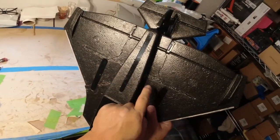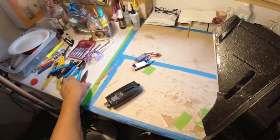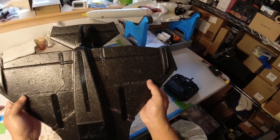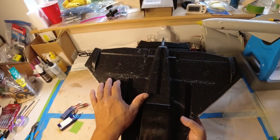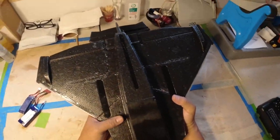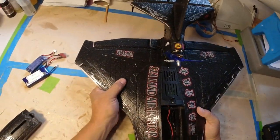There is a carbon fiber rod right here. What I did to assemble this is I inserted it and just kind of loosely set things up. The carbon fiber rod was actually a little too long, so I had to cut about a half inch off the end because it didn't sit in the channel well - it exceeded the trough by maybe a quarter inch. I loosely fit this together without gluing it first.